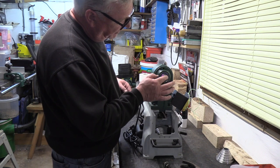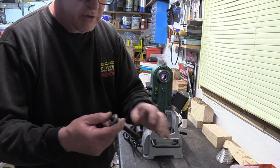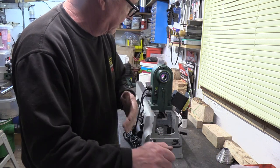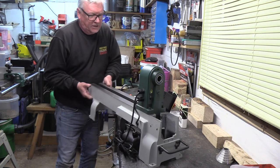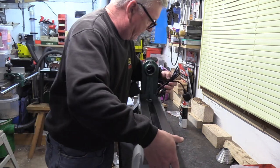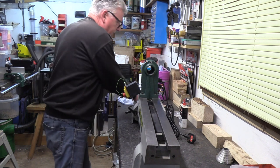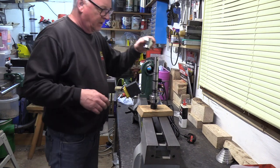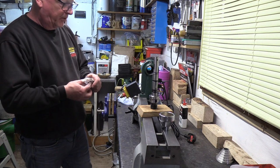What you want to try and avoid is hitting it in the actual bearing case itself. So either cover the whole of the bearing with something like that, or use a shaft with a decent sized washer on there so you can get a bit of leverage on it. So like I said, I've already fitted the one bearing. I used the hand wheel shaft as a slide hammer.